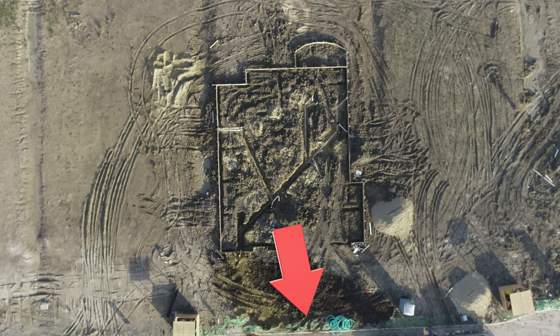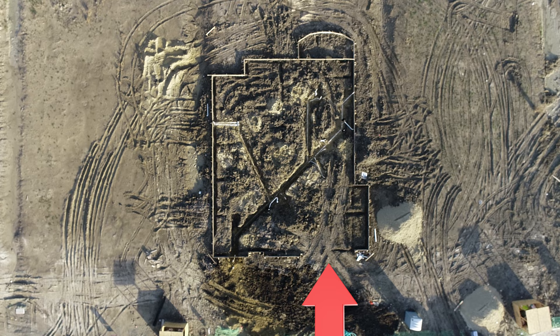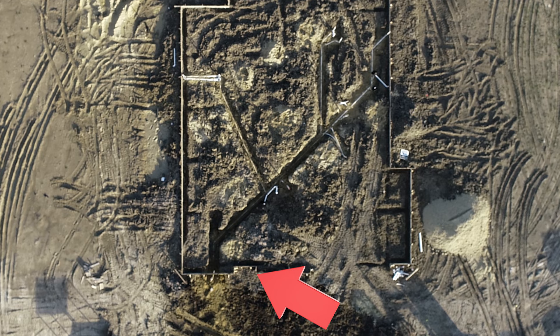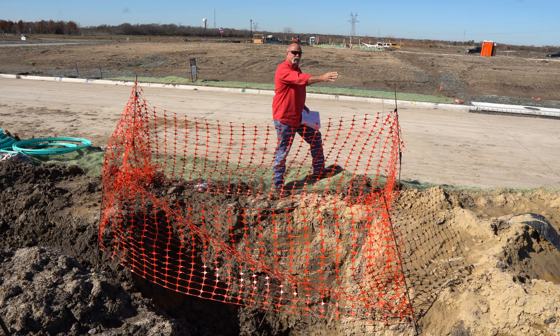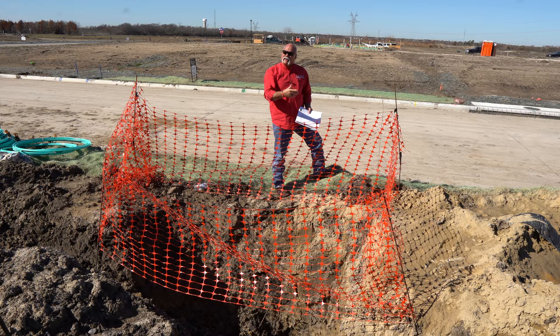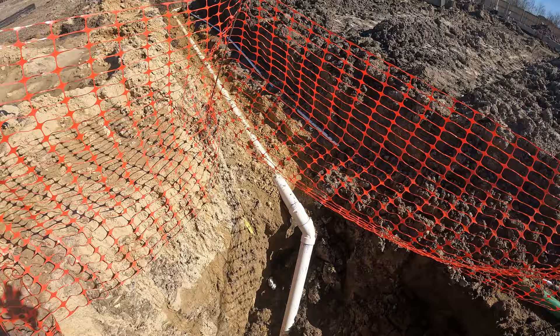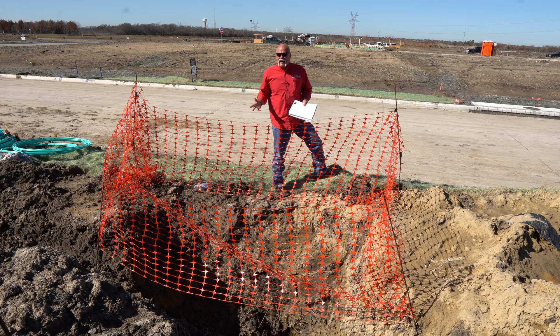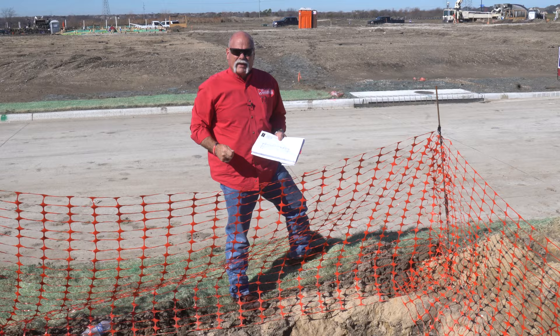Looking at the drawings, the city tap is right about the middle of the house. There's a garage entry here, so I assume there's a driveway there — that's probably why the plumber offset everything over to this side of the house. He could have gone right through the center, but he went to the other side. The only thing I don't like about that is you're crossing under a sidewalk and the main entryway, probably even a city sidewalk which we have no control over. I would have probably turned right here and gone straight back into the middle of the house.